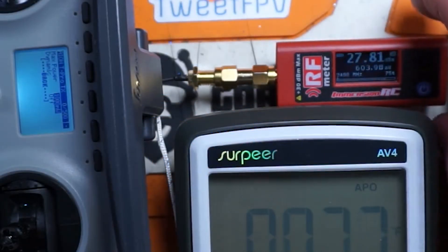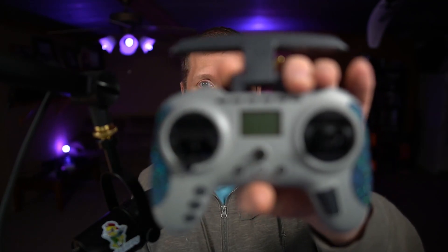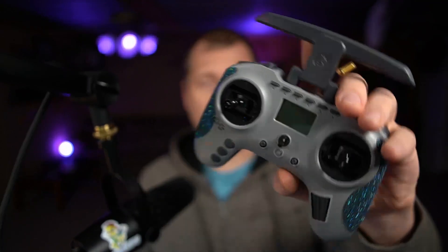Already we see we jump up to about 600 milliwatts — 614, 615, somewhere around there. That's about as good as it ever does. Yep, that's right folks, I messed up. I'm definitely one to admit when I'm wrong. Thanks for coming in, welcome. We're talking about this again, and the mistake I made comes down to this — the ImmersionRC power meter. When I did my thermal testing of this radio versus the power output, the most I ever saw was 600 milliwatts.